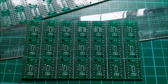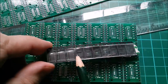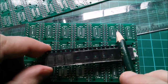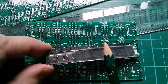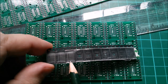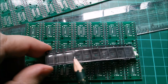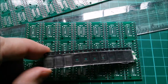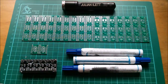I haven't yet managed to find the V2.0 board. The narrow chips do fit on this V1.0 board, but I'm hoping the wider chips will work too if I use my solder paste technique — that's really why I'm carrying on with the solder paste approach, apart from enjoying it since I've never done solder paste before. I'm hoping the solder paste will sit under the inside curve of the chip leg and attach itself to the pad, allowing the wider chips to be used on the V1.0 board even though they don't strictly fit.